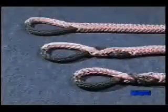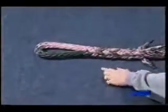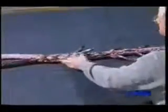Notice that in all three of these popular splices, the tail is buried into the body of the rope for a certain distance. That's not the case with the tuck splice. In the tuck splice, the tail of the rope is unbraided, then interwoven back down through the rope to create a splice with a smooth, even taper that causes very little wear in use, offers minimal distortion, and cannot be pulled apart. The tuck splice develops 95 to 100 percent of the ultimate strength of the rope.